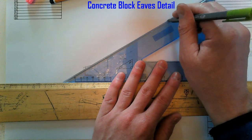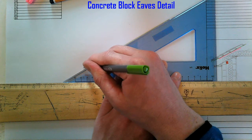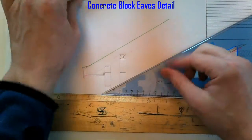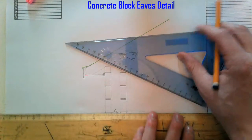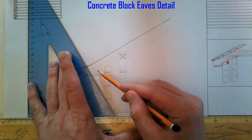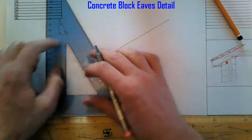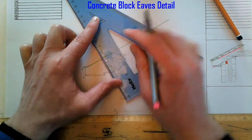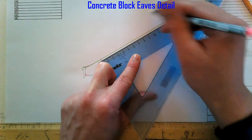I'm going to put mine in green here. To accommodate for airflow up into the attic we also have a vent in between the rafters. I'm going to start my vent so it comes down and gets the air from the soffit area. I'll put it in pink — it's 30mm by 700mm long.